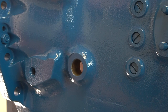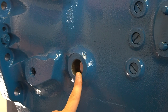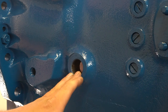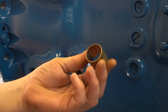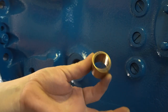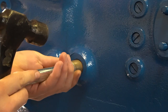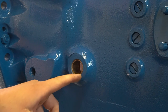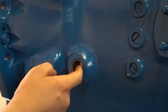The next part to put on before we send this back to meet up with the rear end is we're going to work on our clutch shaft and fork as well as the throw out bearing. First I've got to put new bushings in here. These bushings from New Holland are extremely expensive - I think they're like $60 a piece. However I got these bushings here from McMaster-Carr, Amazon, or eBay - these are just bronze sleeve bushings, about a one-inch inside diameter and an inch and an eighth outside. I drove them in to where the chamfer stops. When I go to put the shaft in I'll put some grease in here - these are oil-lite bearings, so they have like a 30-weight motor oil in them already, but I prefer putting grease on them.